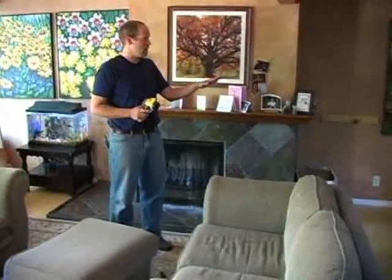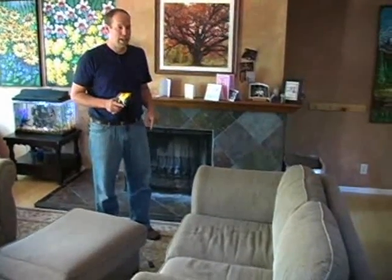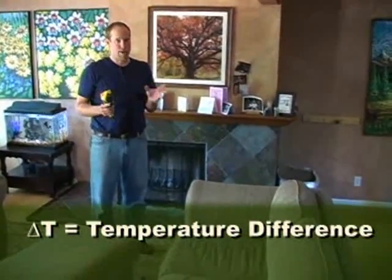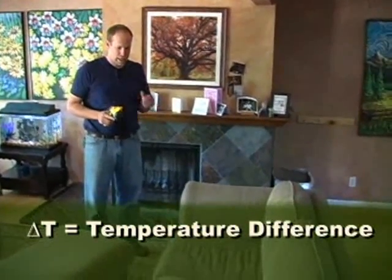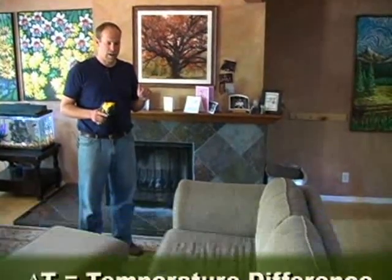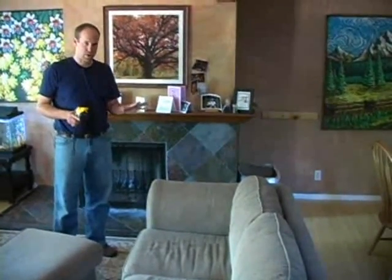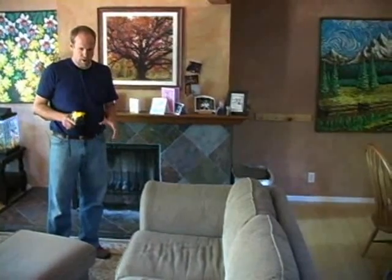So let's try a kind of energy audit. We've had the central air on for a long time. It's about 72 degrees, I'm looking at the thermostat, and it's almost 90 degrees outside, so we've got that great delta T. What we're going to do is turn on some exhaust fans and close the windows and doors, turn down the appliances that are fuel fired, like the gas hot water tank and the heating system, make sure that they don't fire up, and don't turn on any other appliances. And we're going to have those exhaust fans turning on to make a low air pressure system in the house.